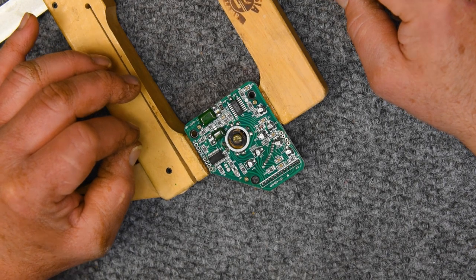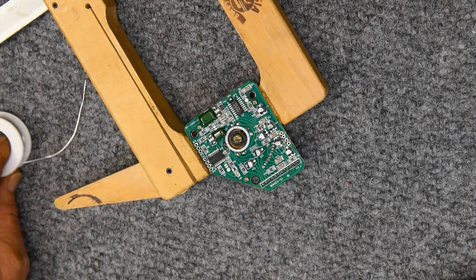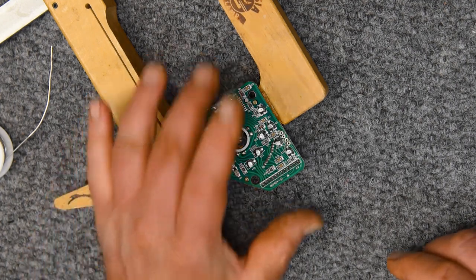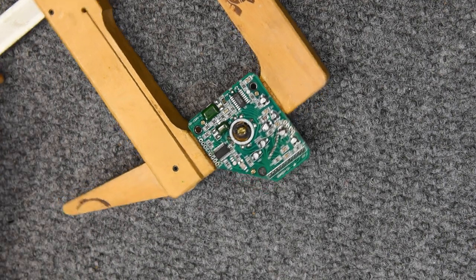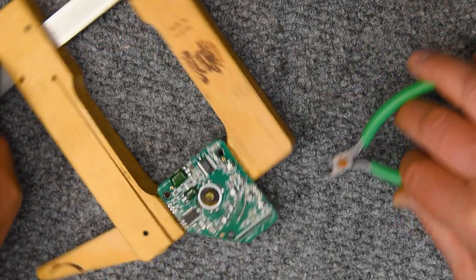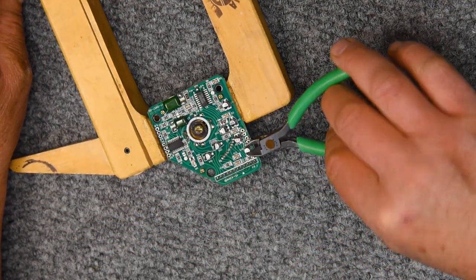I typically prefer the snipping them off method. It's safe, it's quick, it's effective. There are right ways and wrong ways of doing that. I don't like the twist-off method. I think that's a disaster waiting to happen. But on the snipping method, the thing that's really important is to snip parallel to the leads, like this, not at right angles to them. Not like that.